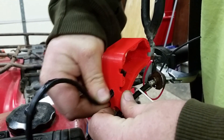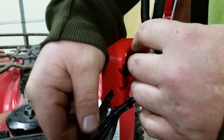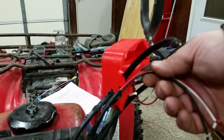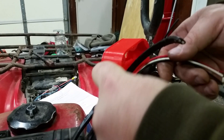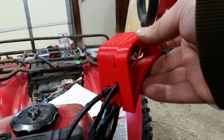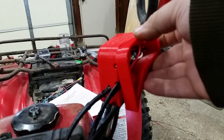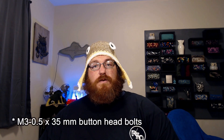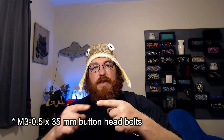I put it all together and of course my measurements for the push connectors onto the back of the switches weren't long enough, so the plate ended up pushing the switches out towards the front. So I went back into Fusion 360, press-pulled out the back of the design by about 20 millimeters, then did a split body function, cut off the back, and used that as an insert — placed between the front unit I had already printed and the back plate. I used 35mm screws on the back, threading 15mm into a 2.8mm diameter hole in the PETG, and that holds just fine.